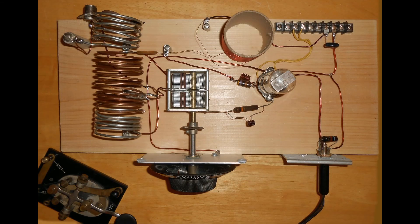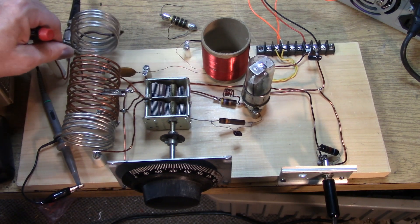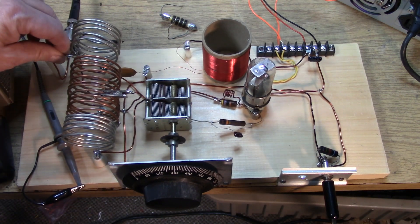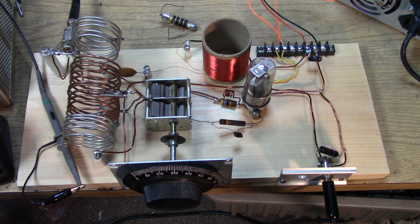There's not much to it. There it is — the entire oscillator with a 6J5. The output coupling link can swing; in other words, we can move this link out. With the swinging link we can loosen the coupling or tighten the coupling, and you just tighten this screw to put it in the place you want. That's a pretty simple transmitter, and it gives you a place to start. Now, the 150 volts didn't give us any more than one watt out, but one watt out is very encouraging.